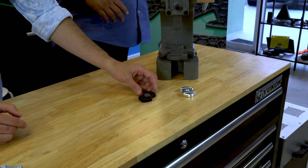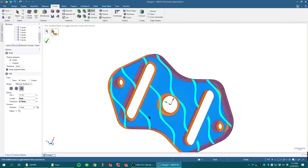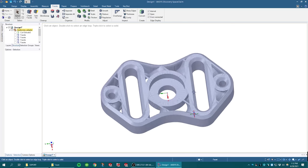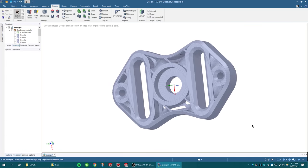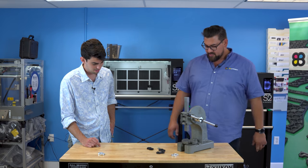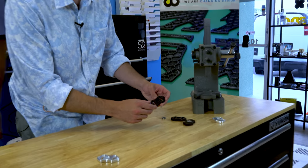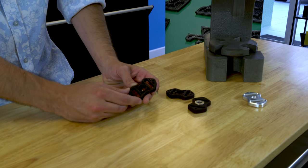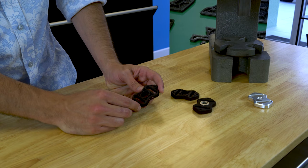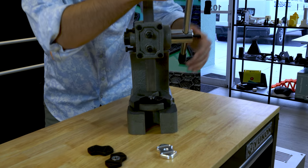I've got a little surprise for you — in that batch of 50, we snuck in a couple of special parts. We actually did a lattice structure on these and light-weighted them. These two different lattices are talking about 25% lighter just by playing with the model. We'll see if you want to pop a bearing in there — the geometry is exactly identical. These are already really small parts with huge slots in them, so for it to be 25% lighter, that's pretty incredible. You can imagine if this was a huge plate or some other kind of structural part, those weight savings could really make a difference. It's even better than the last one — 25% lighter. Now if we compare that to aluminum, that's going to be a massive savings in weight.